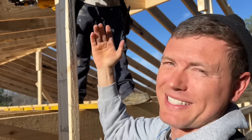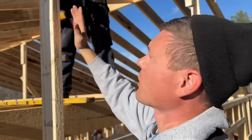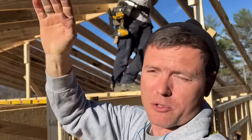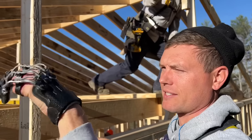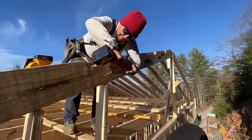Something we have to check for is that this rafter is not crowned or sagging. If it is, we're going to push it up or pull it down, because the overhang will then also have that same crown or sag. We try to get it as straight as possible. I like straight fascias. So we're going to laser eye the sag or the crown, straighten it, and then we're going to stud these in like we're doing here.